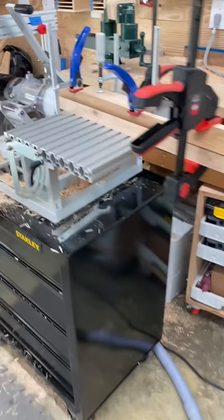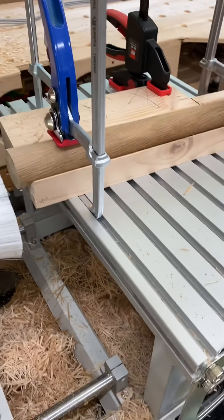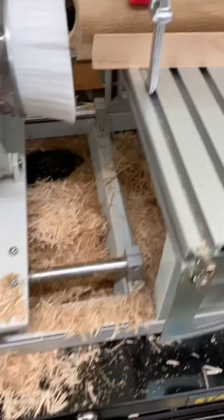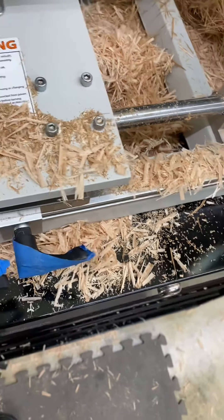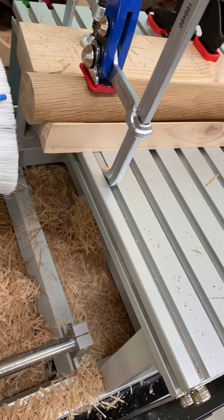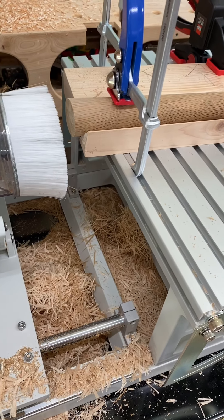Over at my Pantorouter I've got a little jig setup going on. The blade is basically five degrees off of 90, so 85 degrees. I've got a stop block so they all end at the same length, since Elizabeth gave me the same taper on all of them. I've got blue tape on the stop block which means don't move it. Next I'll set up to do all of the mortises on the legs as well as on the table, and then fit a dowel cut with the tapering.